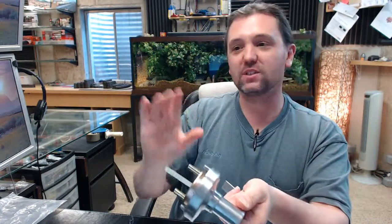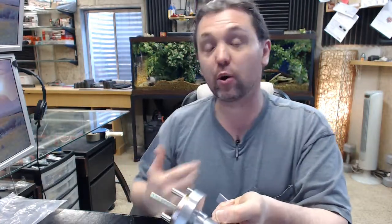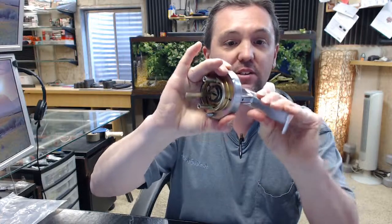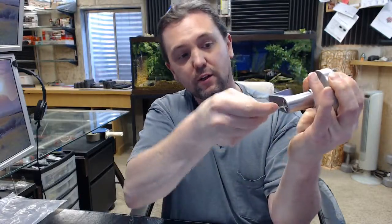The entry function on this lever trim means it acts like a classroom lock, which means you can leave it locked or unlocked, and that control is done via the key. The key goes in, you turn it 90 degrees, remove it — it's locked. Insert the key, turn it the other way, and it's unlocked. You can remove the key either way, so you can leave it locked all the time or unlocked all the time.